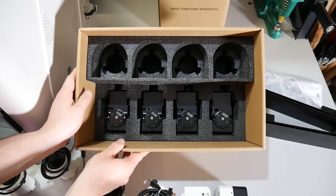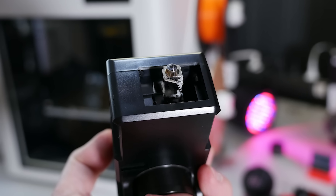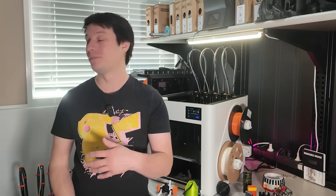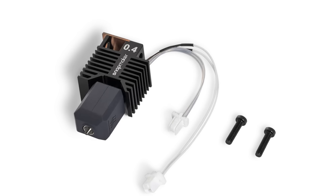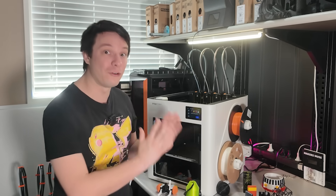Being the production version, I was very curious to inspect the quality of the tool heads, and we've come a very long way in just a few years. These extruder units all have a complex integrated extruder and hotend assembly, which unfortunately means the days of simply changing nozzles when you have a clog are long gone. The heat sink, heat break, heat block, and nozzle are all one unit and you need to replace everything in one go. It's a direction the industry has been moving in, and I'm okay with it so long as spare nozzle assemblies aren't too outrageously expensive.